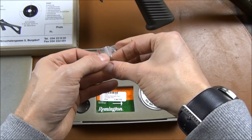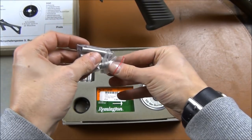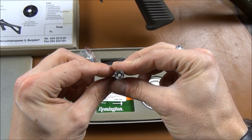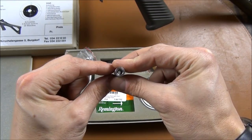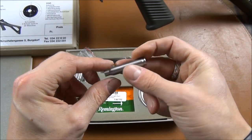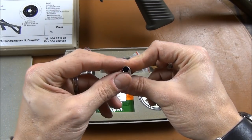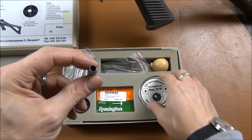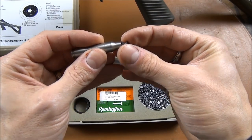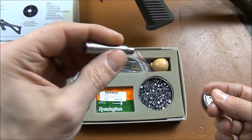The cases are steel, .223 shape or GP90. They have a primer pocket which just has a rim large enough to retain the primer and also secure the anvil so you get good ignition. There is a seating tube in the mouth into which you push in the pellet just with your fingers. With the primer on there you're good to go.